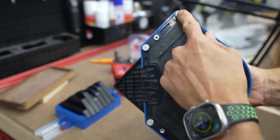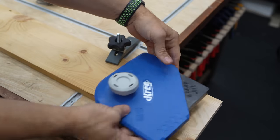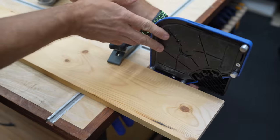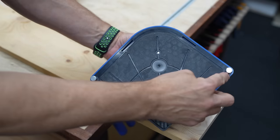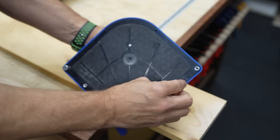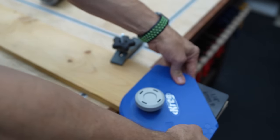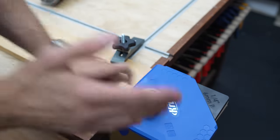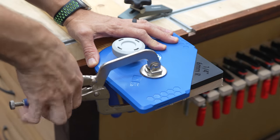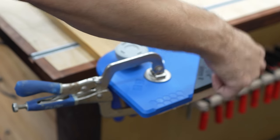With a quarter inch radius selected, these posts also adjust — you can move them up to the next hole if you need to get closer to the edge. On the long side I don't need to adjust because both posts are making contact, but on the short side only one is, so I move the threaded post down to give me two points of contact on each side for a secure grip. Then I pull back on this and use my router to go around that edge. If you don't want to hold it, a face clamp works perfectly. I've got my Whiteside router bit installed and I'm using the top bearing to follow the template — that gives me that quarter inch radius right on the corner.